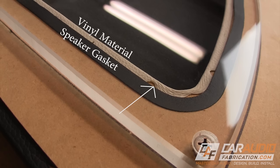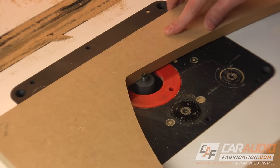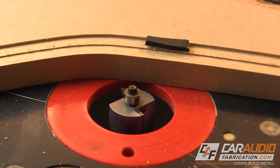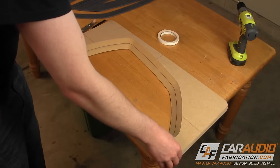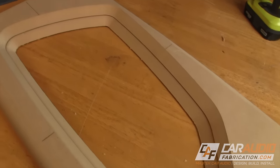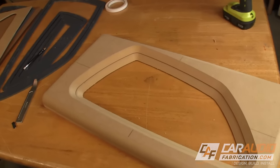Next, we need to make another cut so that I can wrap the vinyl material around the backside of the panel and adhere it so the front is perfect when complete. In order to make that cut, I load in a smaller rabbeting bit and just cut slightly deeper. Here you can really see how I created the two steps. I put a small piece of gasket on there to help visualize the finished product. I've also copied this shape to a second piece of wood and used a layer chamfer technique to give the front of the panel some added customization. But the focus of this video is adding the acrylic window, so let's get to cutting the acrylic.